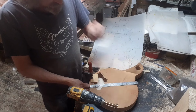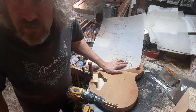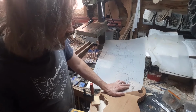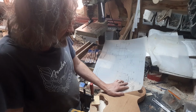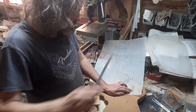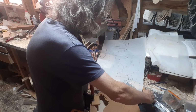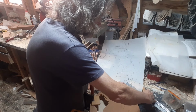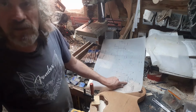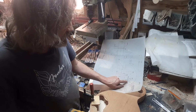Also with this, it's a 1-inch diameter hole, 25.4 millimetres. Now, it doesn't go all the way through. It just goes in, again, I did it by scaling it, about 33-34 millimetres, and then the remainder of it is drilled through with a 1/4-inch drill.